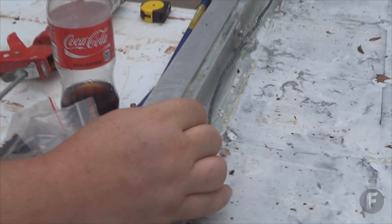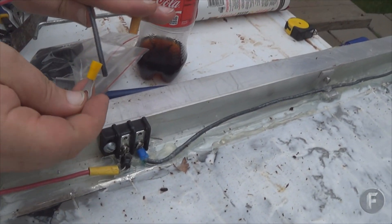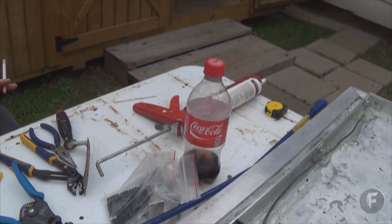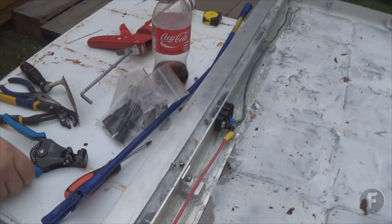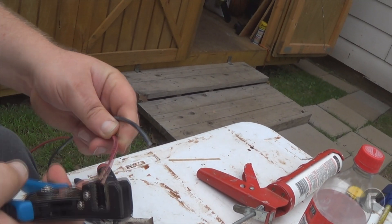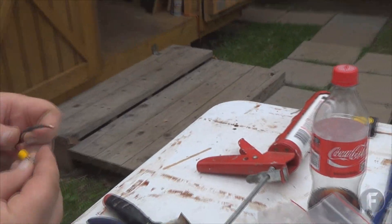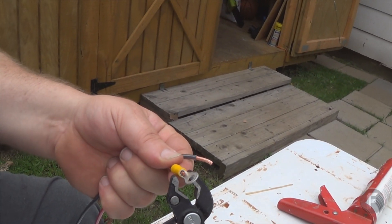For my connections with my little junction box, I like to hook up little wires and then attach these here and show you how to hook up these quick disconnects, so that way you can have them in between your panels in case you just need to take one out without having to recut the wire. The first step is to strip it about like there — these are the best pair of wire strippers. Slide your wire in here, you see it poking there, and then crimp it right about there.